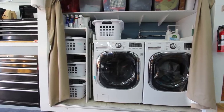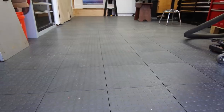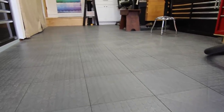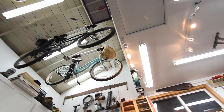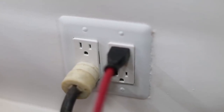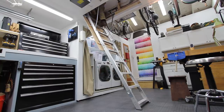Laundry. This is the laundry area that I built, and thanks to our two boys, these are also the two most-used machines in the whole shop. I put up some heavy curtains to keep all the dust out. The old garage floor was in pretty rough condition so this snap-together plastic flooring was a huge improvement — it's a lot softer on my feet and back, it's easy to clean, and if I drop a tool it's a lot less likely to break. When Todd helped me get set up with the electrical, we installed four separate circuits: one for lighting and ceiling outlets, two separate circuits for the wall outlets, and one more for the laundry area. We also pre-installed some 220 wiring in the wall if I ever wanted to add a dedicated circuit for a dust collector in the future. The ceiling drops down lower in this part of the shop because I built an attic for storage — it's reinforced for a heavy load and tall enough to stand up inside.